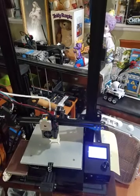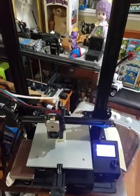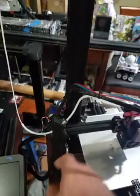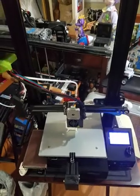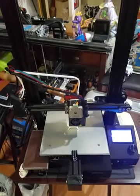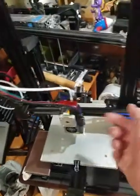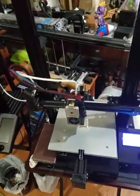It took me a while. I decided to just cut off the cables for the heating cartridge and the thermistor, and replaced them with new ones. This printer is 500mm tall, so I have to take all the wiring out, go to the board — it's a challenge, a lot of work. Rewarding, but a lot of work. I cut those off and instead of going through all that work, I just put the new heating cartridge and the new thermistor, plugged it directly to the board, cables out, and plugged it into the motherboard and placed them over here. When I tested that out, they worked like a charm. No problem.